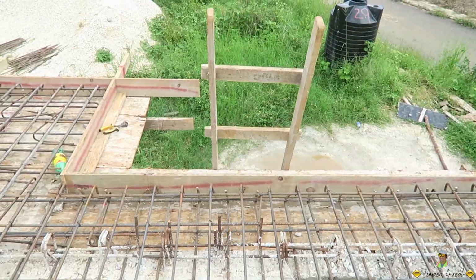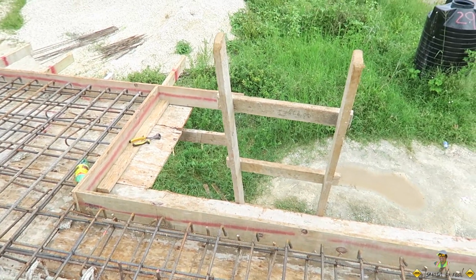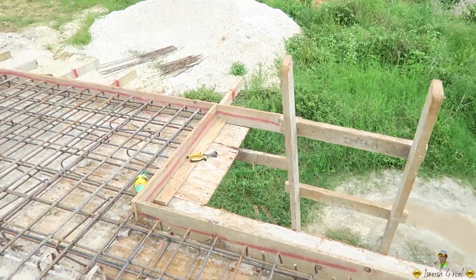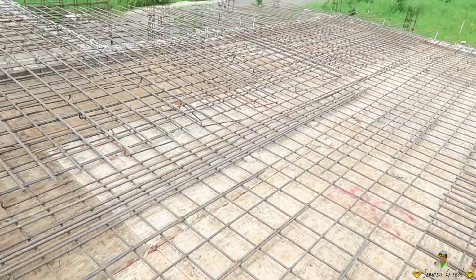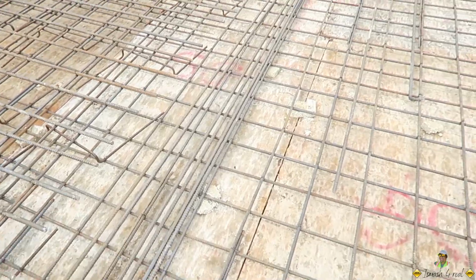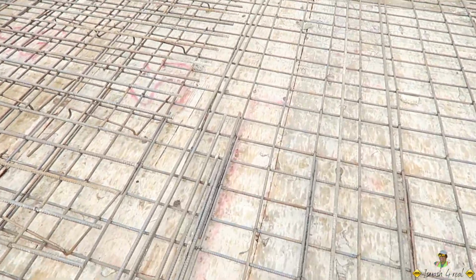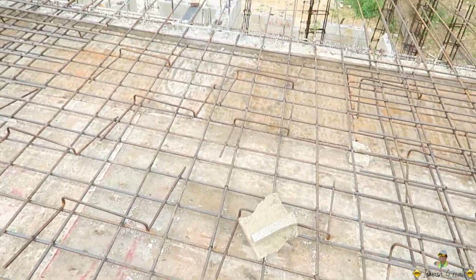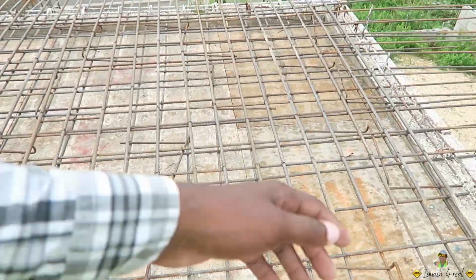So firstly, by all means, please ensure that your ladder extends past the point of landing, that is the correct and safe way to do it. Make it rise another 2 to 3 feet above the point of landing. That is the safety procedure when you're using a ladder.